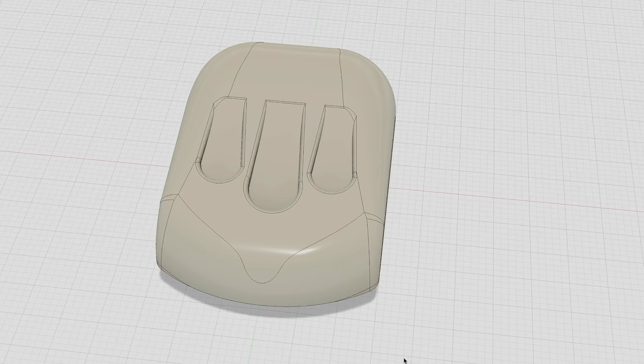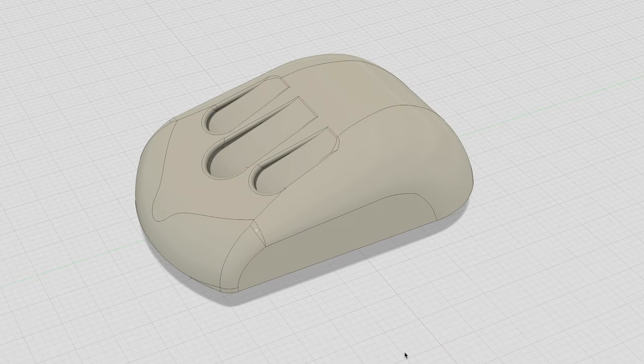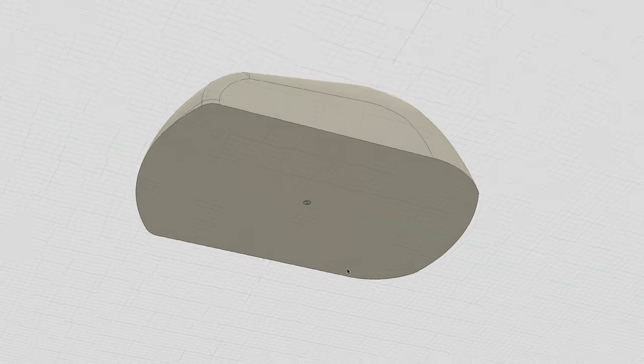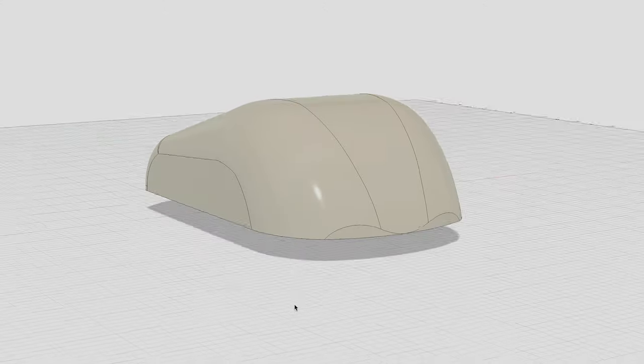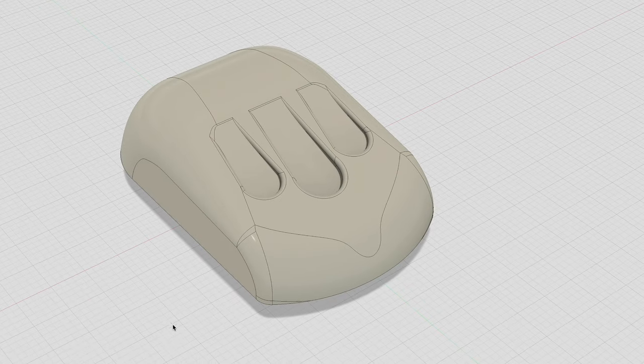First, I love this idea, but it just proved impractical, and that is a 3D printed sanding block. This is the second version of the design that is a little bit more simplified than the first. It's easier to print and much less assembly. But why was it a miss? Well, it takes over 3 hours to print, needs Velcro added to the bottom to hold the sandpaper on, and it's not very flexible. It's made out of hard plastic.